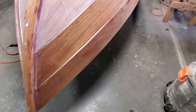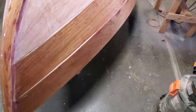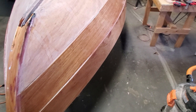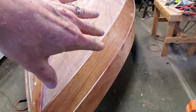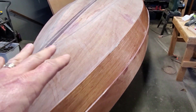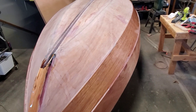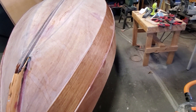Right now my focus is on epoxying the two upper planks — the shear plank and the intermediate plank — so that the plywood has good long-term protection against checking from sitting in the sun or from water issues. Once the outside is completed and primed, I'll be flipping the hull over. On the inside, I'll also be glassing the bottom with fiberglass cloth and epoxy to protect against dropping things like anchors, and coating the inside of the strakes with unthickened epoxy, just like on the outside.